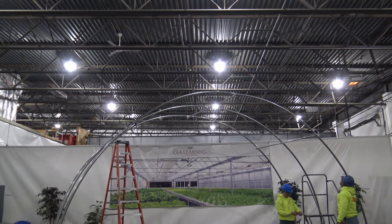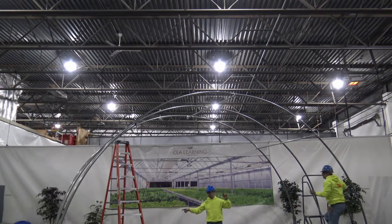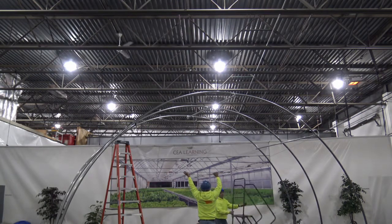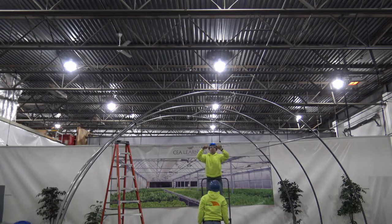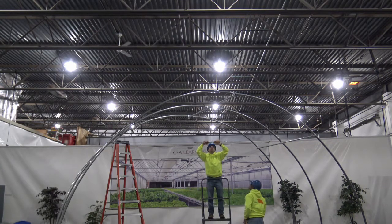Attach the turnbuckle to the inside cable ends, tying the two cables together. Tighten the turnbuckle snugly. In most cases, there will be multiple cables that will need to be tightened to square the building properly. Reference your instructions for further instruction.